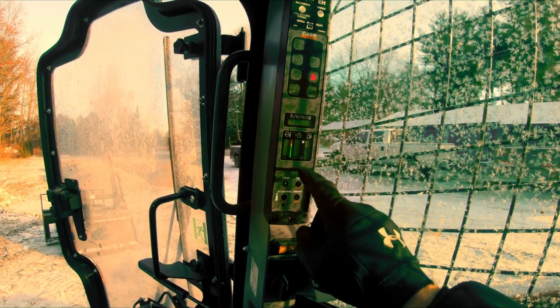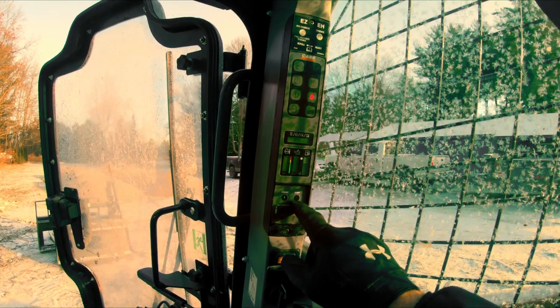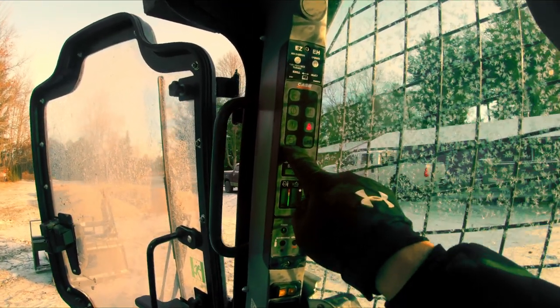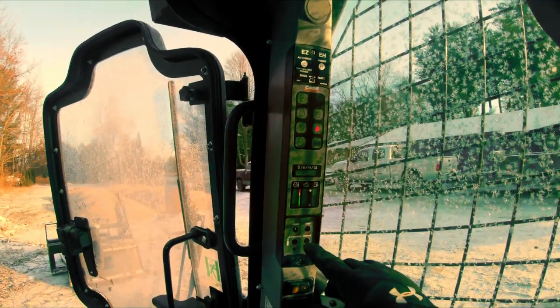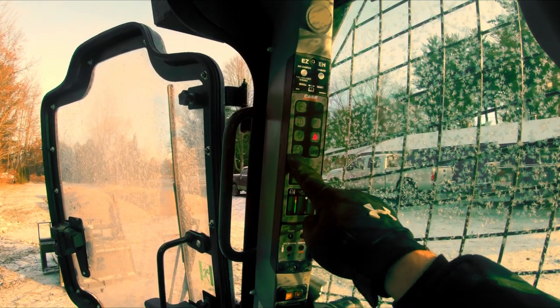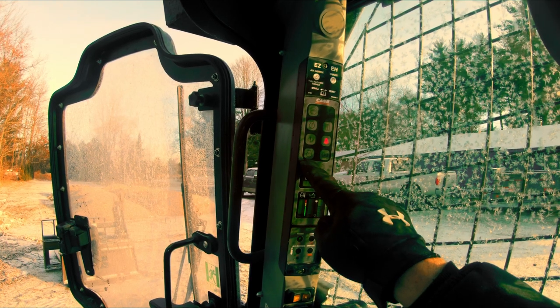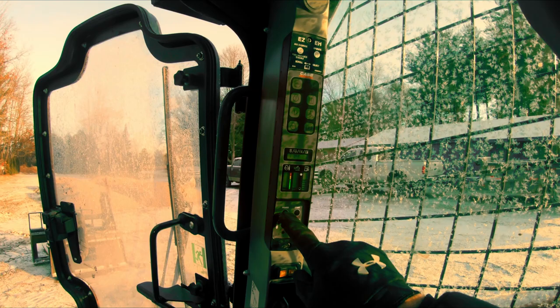But in a cold climate like this, when you want those glow plugs to work and do their job, we're gonna look at this emblem right up here with the little curlies inside the engine. Let me get you a little closer so you can see it, that one right there. That's going to light up when I push this power button. And what that's telling us is the glow plugs are warming. And when that light clicks off, that tells me that they are warm enough that I can start the engine. So we're gonna do that right now.